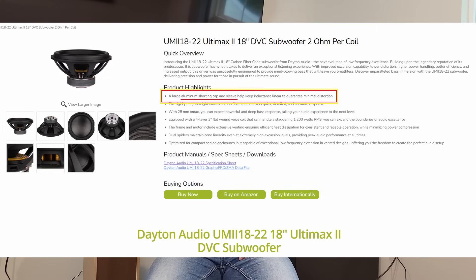Despite that, I spent a lot of time listening to this subwoofer — anything from rap music, to action movies, to rock and roll. The subwoofer sounds amazing and I'm very happy with it. I do think the extra time and materials spent on distortion control on this driver was well worth it for Dayton. The extra copper or aluminum in the motor definitely helps the driver sound clean. It's got a powerful motor, so it handles this relatively small box well. We get nearly a 12 dB per octave roll off, so I'm quite happy with the performance.